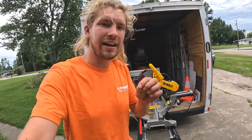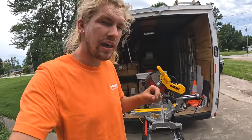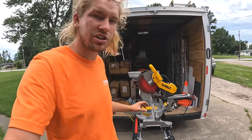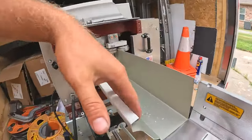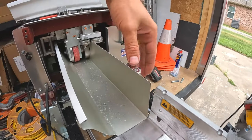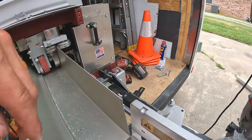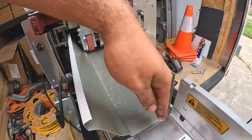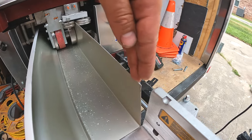Additionally, if you have a combo machine, like a 5/6 inch combo, you want to go ahead and switch the machine over to the larger size. This is because the 6-inch gutter on my combo machine sits further towards this passenger side than the 5-inch. The 5-inch typically ends about here, while the 6-inch ends here.